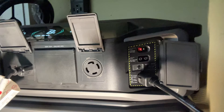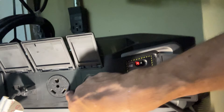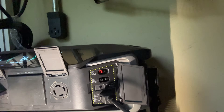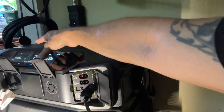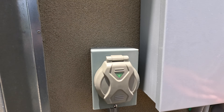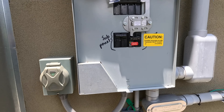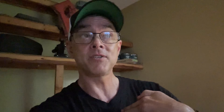Using this connection I have on the side of my house, I can power my house with it as is — just as is — up to 30 amps. This can also power an RV, so there's a lot RV companies could do with something like this. I'm going to show you my generator input and how this can hook up to my generator input on the side of my house to use it as backup power. I can use it that way, but I have to kill the power to the house to use it. I'd really like to hook up their transfer switch and be able to supply any kind of power to my house.